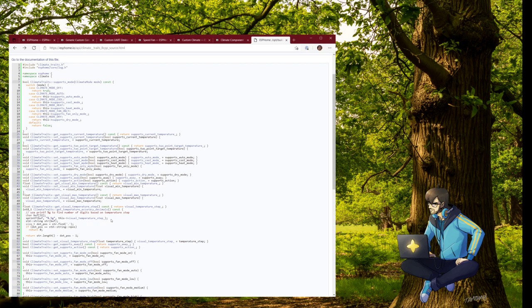What you don't see, because I didn't turn on the camera this time, is that I now have the breadboard here with the ESP32 dev kit, the same one that I actually want to set up for the air conditioning, connected to one of the two LIN bus transceivers. The other LIN bus transceiver is connected to a serial adapter that is connected to my Linux machine, which is the one I'm going to be using for the actual running of code. And it's going to be running the HVAC emulator pretty much.